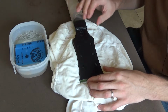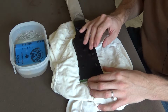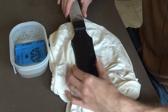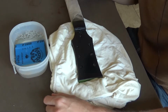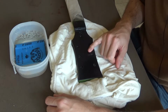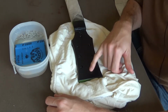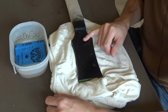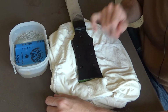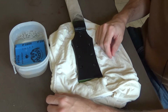So I'm going to try and be as careful as I can, with the wet dry, not too wet. Don't just go splashing water everywhere. We'll see where we end up, and maybe we'll learn. I'm sure we'll learn something about the order in which we do things. Maybe I should have done the front face of the headstock first, and then followed that with staining the back and sides, because I guess the nitro-cellulose paint will resist the stain much better than the stain will resist the water we use to do the sanding of the headstock. So let's give it a go.